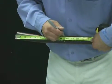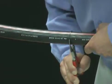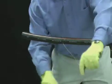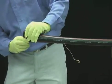Make a mark on the cable at the defined dimension. Make a ring cut using the Tyco Electronics EXRM-1004 Ringing Tool — this is a very sharp tool, so light pressure should be used. The ring cut should be made to go less than 90% of the way through the jacket so you do not damage the concentric neutral wires underneath. Expose one of the concentric neutral wires and begin to pull back toward the ring cut. Take care not to break the neutral wire by over-twisting or bending. Once back to the ring cut, remove the jacket starting at the cable end, following the spiral made by the neutral wire.